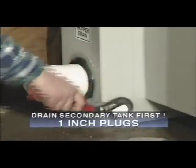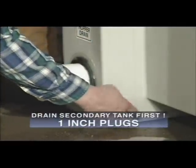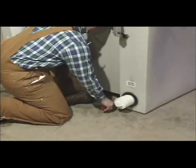If there is liquid in the secondary tank and none in the main brine tank or hopper, these two inner tanks will act like a bobber and can lift upward. This creates excessive force that will literally tear apart the tanks and piping.